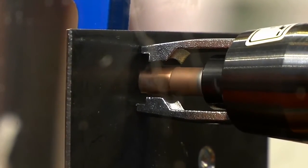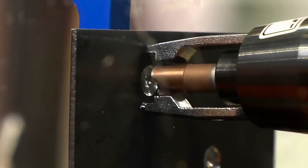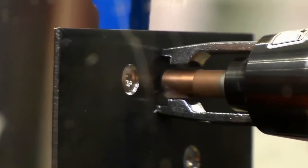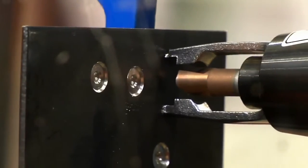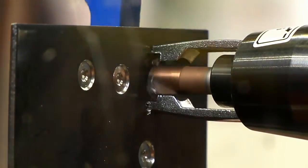This is a regulated speed so we don't have to worry about going too fast and burning the bits up too quickly. The free speed is 1,000 RPM. The drill speed is about 700 to 800 RPM. So it keeps it at a relatively low speed to keep the bit cooler.